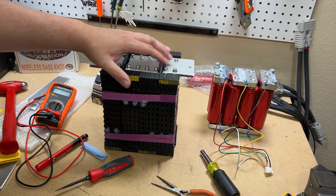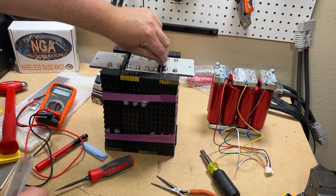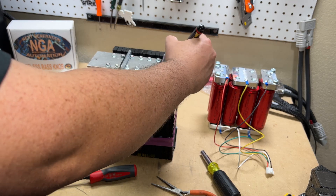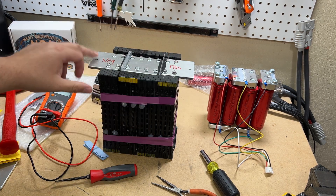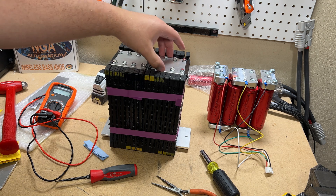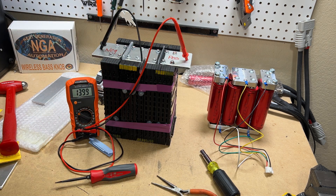I've got a little bit of space here that'll be closed up once I get some compression on it. I've got some electrical tape and plastic as cheap insurance — a little bit of plexiglass. I've got a quarter-20 thread in each one of these for the positive and negative power leads. The bottom bus bars turned out a little bit better; they're a lot more even. We're resting right at 14 volts. Let me go ahead and assemble the rest of this battery, charge it up, and show off the whole thing once it's done.